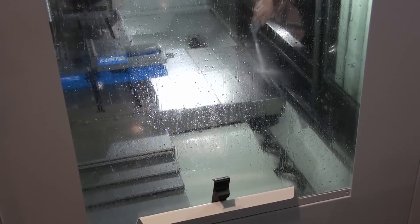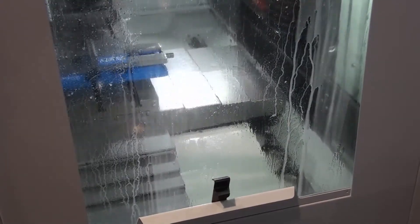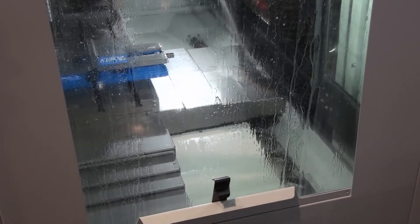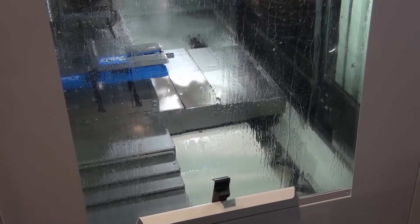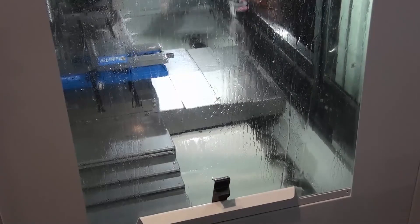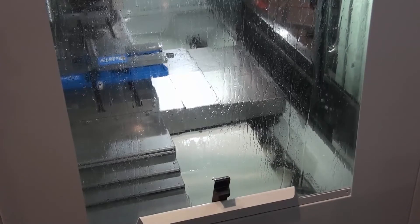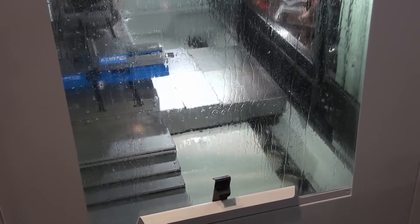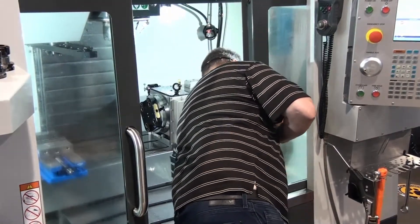Double-check the horizontal surfaces, check all the angled walls, and make sure that there's nothing on any of the walls on the machine. Let the auger run for a little bit to get the rest of the chips out. Turn the coolant off and clear the gun. Clean both the inside of the windows and the outside of the windows.